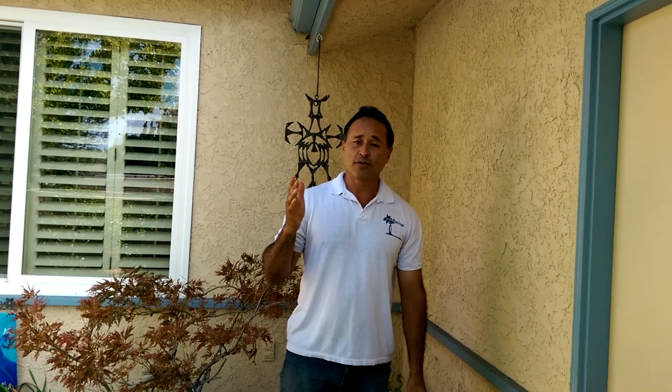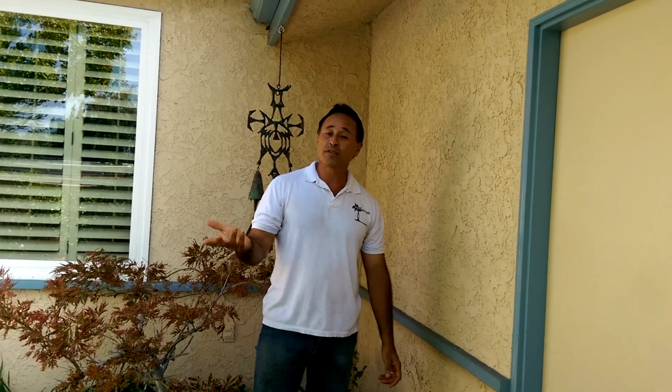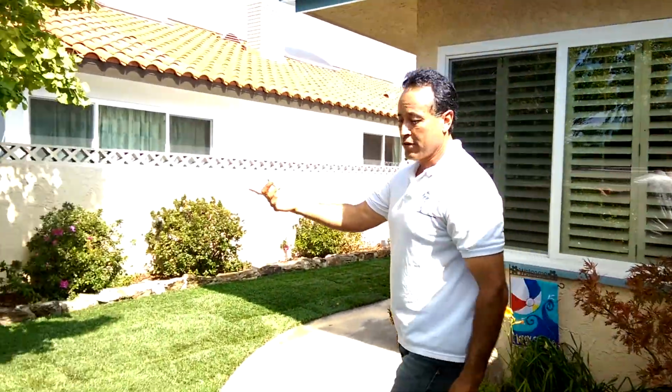So we recommend at Enviroscape LA to do a clean out for your drip irrigation line. What I mean by that is, at the end of the line, you cut the line, you put a little stop valve on there, and once in a while you clean it out. I'll show you how easy it is to clean out. I'm going to turn on a valve here. We have a clean out right here.